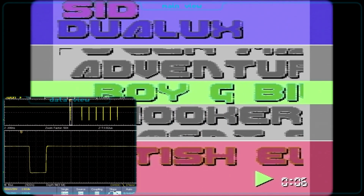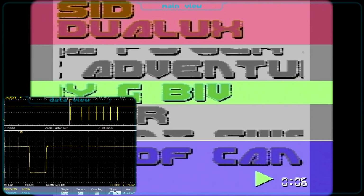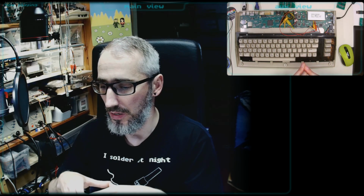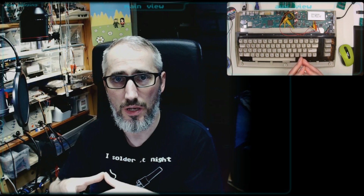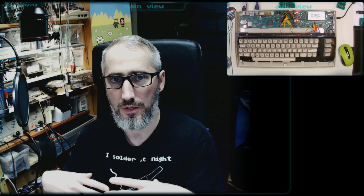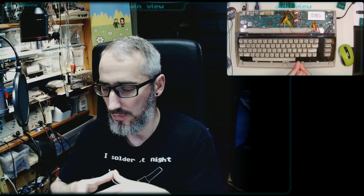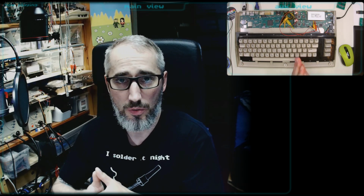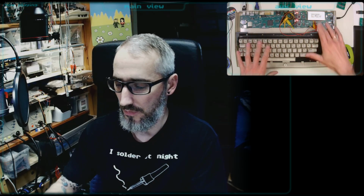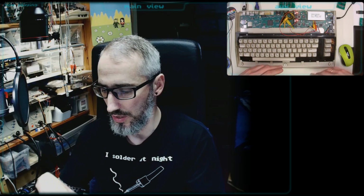So basically, right now, if you have the most recent firmware on your Ultimate 64, you cannot use addresses DE00 as well as DF00 on this FPGASID configuration. And this is a little bit sad. I have communicated this to Gideon just to see whether he comes up with an idea or what the reason for this behavior is. That's pretty unusual, because none of my 64s, whether it's an original board or an individual computers Reloaded board, act in this way. And as we have seen already, the Ultimate 64 is capable of behaving like this, but it is not doing this anymore. So for the purpose of this exercise, I have used a different firmware where those IO signals are still available, so that we can go through the configuration of this whole system and how we're going to change addresses on the fly, for example.